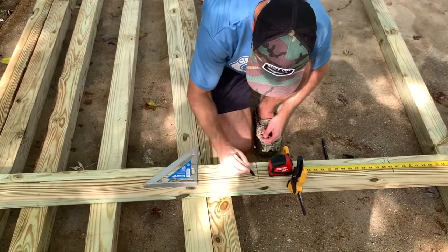So after installing it on the bottom and the sides, I went and I installed the remaining pieces of panel. And then I secured it to the studs, as you're seeing now. And then you're basically just gonna kind of frame around the window, installing the J-trim at the top once you get to that part. And as you can see, I'm installing it right there.